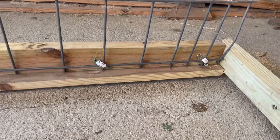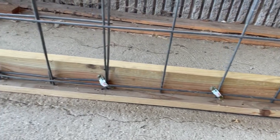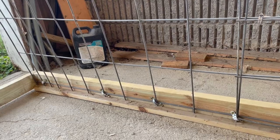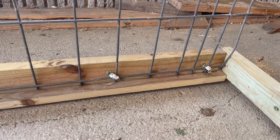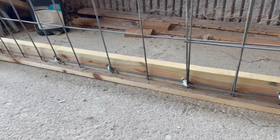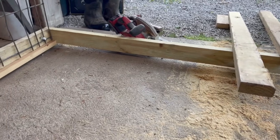We also take that two-by-four and cut a half inch off the end, full in the middle, and then back again a half inch off the other end, so you kind of have a rocker effect on that runner. That way it just helps when you pull it — it gets it up off the ground on both ends. Also, you keep the end two-by-four flush with the top and that keeps it up off the ground so it doesn't dig in as bad when you pull.